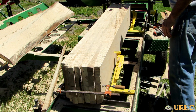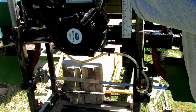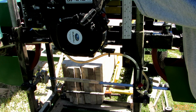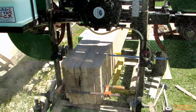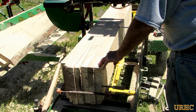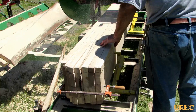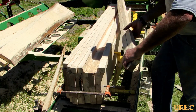It's not like it's hard work or anything at this point - everything is pretty light. That little digital gauge I have for reading the amount that you move it really helps me to easily offset. I'm going about 1.56 inches, just making up for the thickness of the band. It's real easy to get the number, but sometimes it's hard to hit it because that little hand crank does have a little bit of movement between the lock points. So that can take a little bit of fiddling and backing off and redoing until you get it where you want. Basically just cutting it up into the squares now.